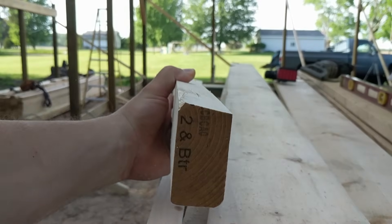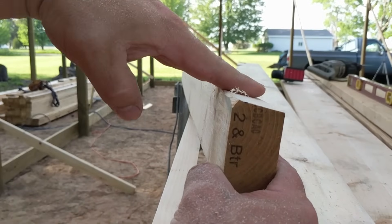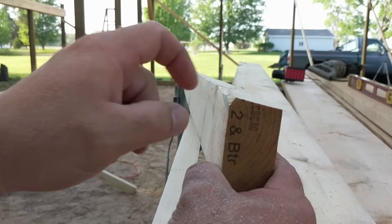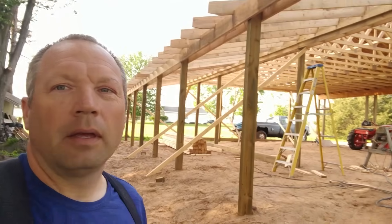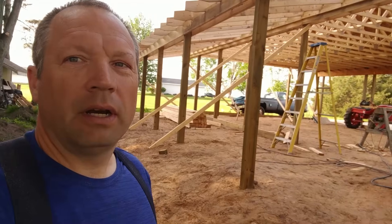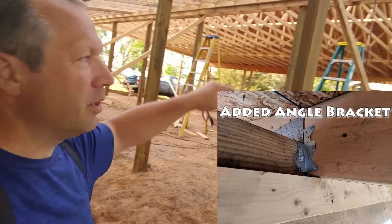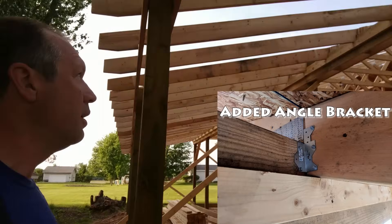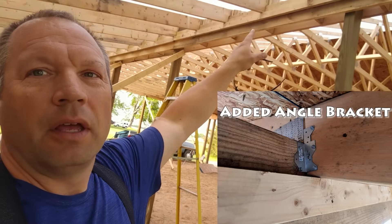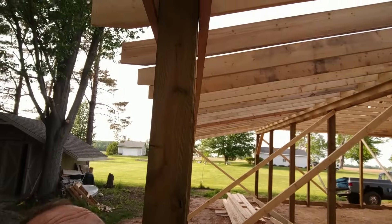The reason why I did this was I wanted that same angle as my rafters so they can rest on it — this will be the ledger board. I got all my rafters up except for that last one. I ran my ledger board — I cut it on a little angle to match the pitch — and on this end I notched the bird's mouth.